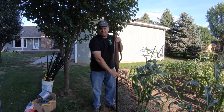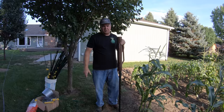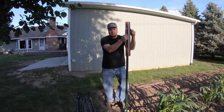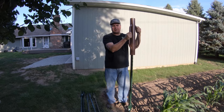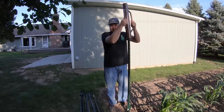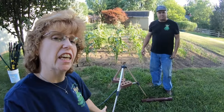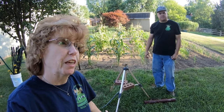Another approach more recently is this type of post where the wire actually just goes right down in here — you don't need any extra insulators at all. You just stick it in the ground, step right on it, and move on. We use these along the side where we don't need necessarily the strength of the corner post. I'm not really worried about how I angle these posts because those lock jaws will go on at any different angle. Neighbor Bob named this thing for us — he called it the Kerplunker.